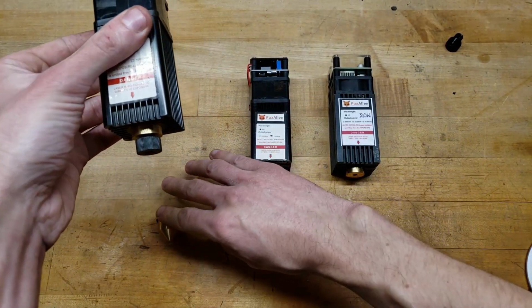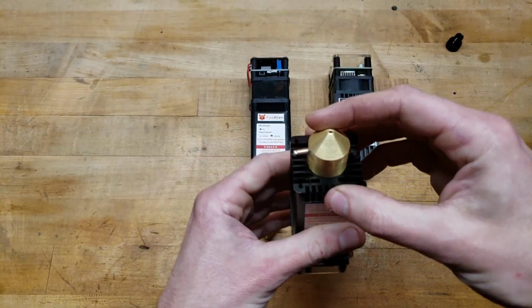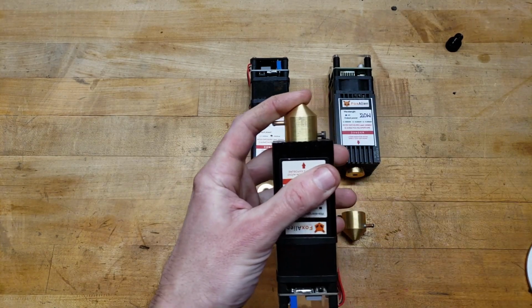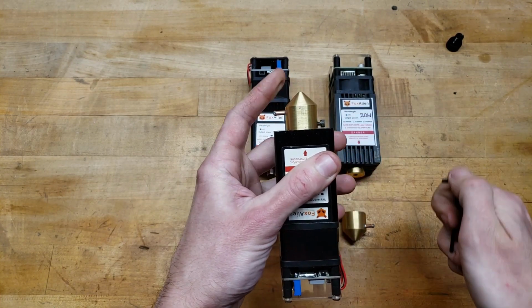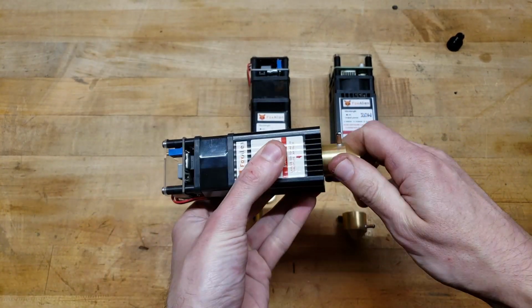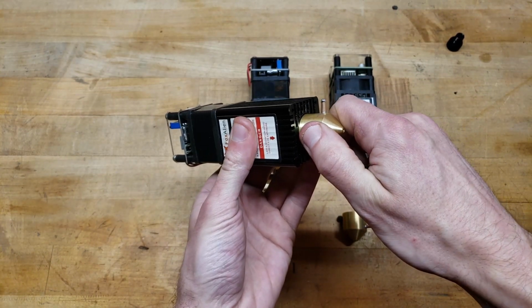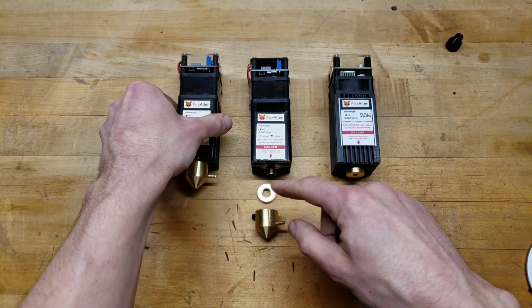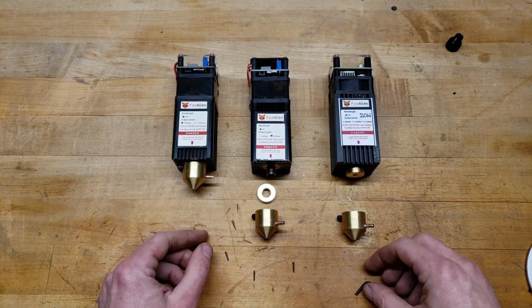Once that ring is locked in, the nozzle just slips right on. And I've machined that very precisely so there's no give and no wobble. That way the laser beam comes out right down the middle. And you torque it in, and you're good. Good to go. Once it's on there, once you've got the set screw torqued on, you can give it another extra little tug, and that's to tighten down that ring further still. Since that lock ring is round, it's kind of hard to put a lot of torque on it, but you can do that once the set screw's on there.